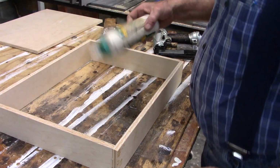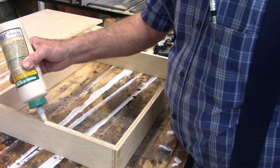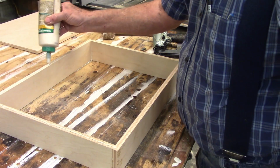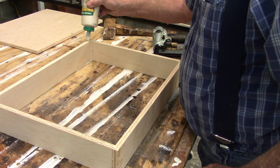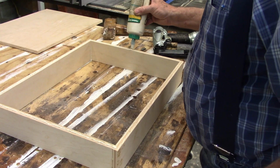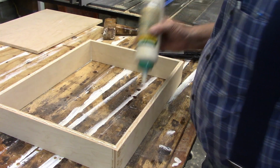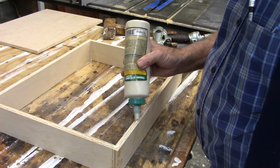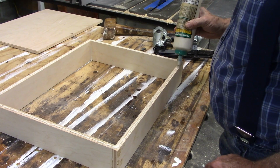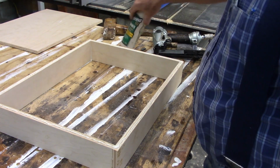One of the benefits of this kind of drawer is you can also use the bottom now to square the box to make sure it's perfectly square. Now my case wasn't perfectly square. Remember, it was an 1/8 inch out, but the world isn't perfect, and if you're only an 1/8 out, you're probably okay.